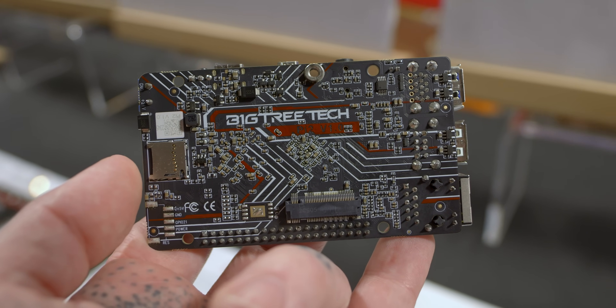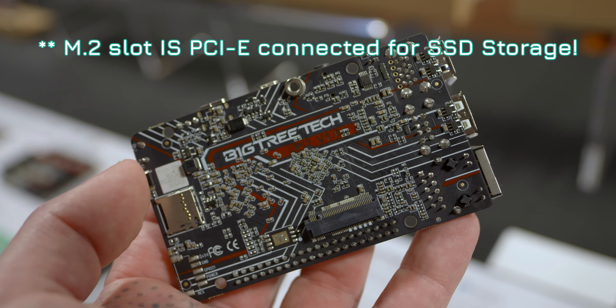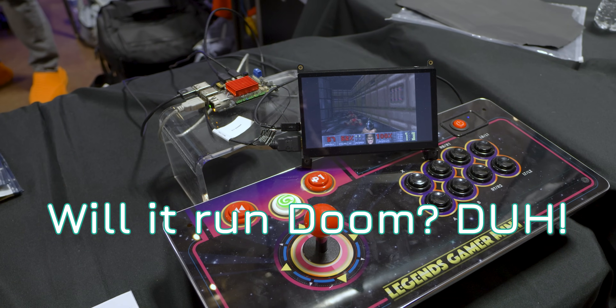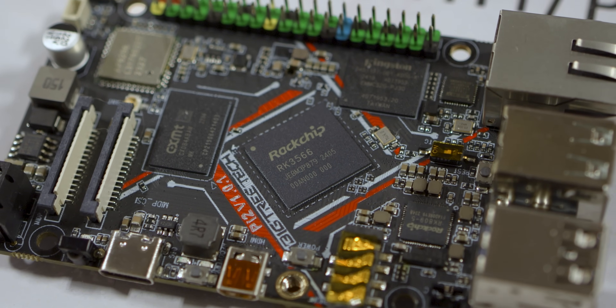There's 32 gigabytes of more reliable eMMC storage on here so you don't need to rely on an often flaky SD card slot for running your entire operating system off of it, though you still have an SD card slot if you want for expansion or if you need to run a bigger storage setup. I actually don't see any mention of it in the marketing material at the moment, but there's an M.2 slot on the bottom of this thing, so you might be able to use a commodity SSD on this for significantly better price-per-gigabyte storage and reliability right on this board without any additional stuff. I've been running a lot of my machines off of external SSDs running inside of housings or 2.5-inch SSDs over USB, which is still not the most reliable or highest speed. This might be a really great option for faster and more reliable storage. And of course, you're not just limited to running your Klipper-powered machine with this board — you can run anything Linux-based that will run on this processor, which by the way is a Rockchip RK3566.